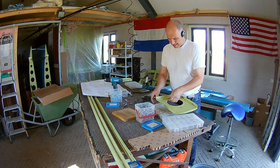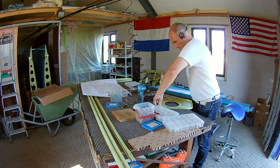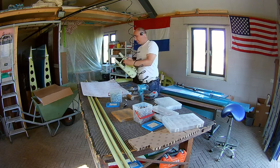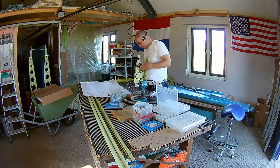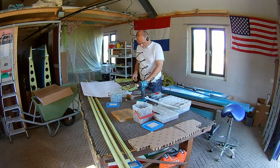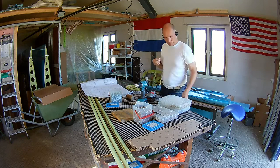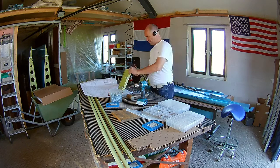That was all the easy parts — that's why I did it by myself. Now the harder part: the 711. It's a two-part bulkhead with some stiffeners that hold the vertical and horizontal stabilizer, so the empennage kit. It's not that hard, just some rivets. I could do almost everything with the squeezer. Only the top two rivets I couldn't do, but actually you shouldn't do those right now because you have to do that once you are going to install the empennage — mostly the horizontal stabilizers.